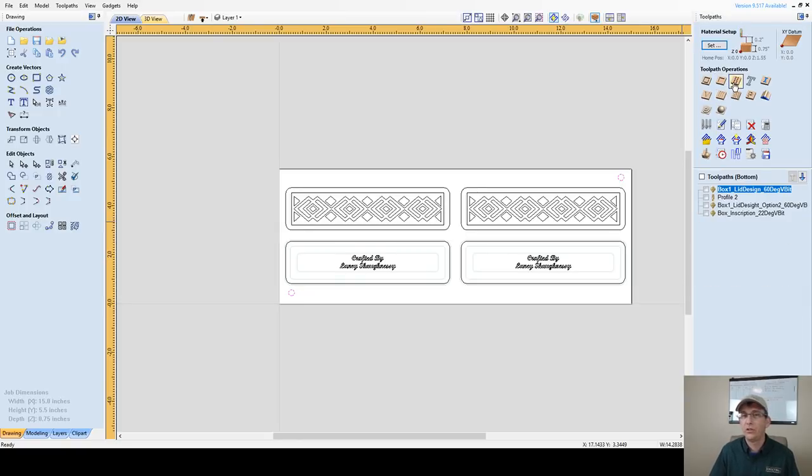Now, you could either do a drilling toolpath with a quarter inch end mill, or if your CNC might have a little flex and you need a precise hole for your alignment pins, use a pocket toolpath with an undersized bit. Use an eighth inch end mill, create a pocket toolpath with it. That'll give you a precise quarter inch diameter hole. If I use a quarter inch diameter bit with a drilling toolpath, and I have a CNC that has a little bit of flex to it, when it comes down and presses down on the tip of that bit, there's going to be a slight amount of flex